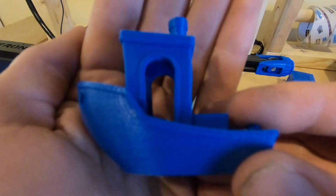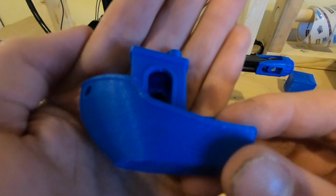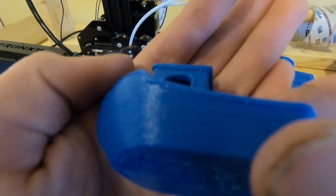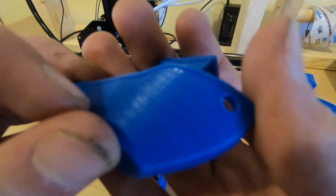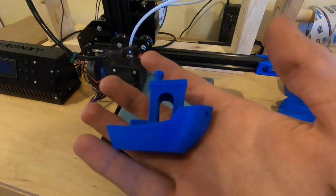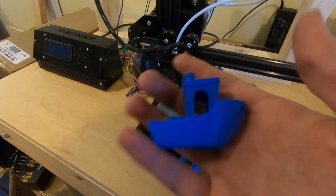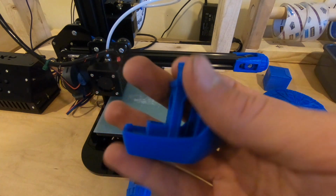It's pretty good quality. You can't really see too well because this camera's not that good. But the biggest thing are the artifacts. So as you can see, there's the lines right there, and it's kind of hard to pick up, but there are more artifacts, like right there, you can kind of see it. There's some bad salmon skin. That is probably the printer main board's fault. If I swap that out, then that probably would be fixed, but that's just too much hassle to go for.